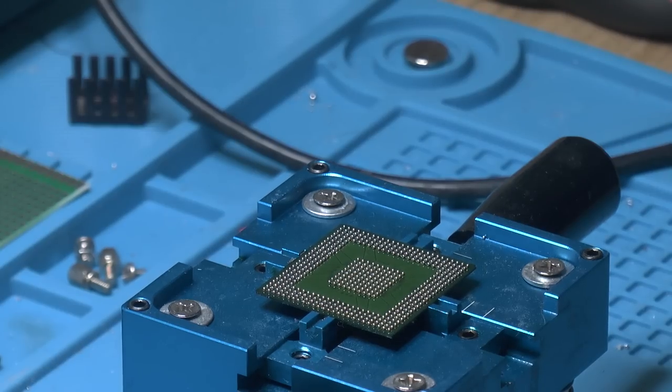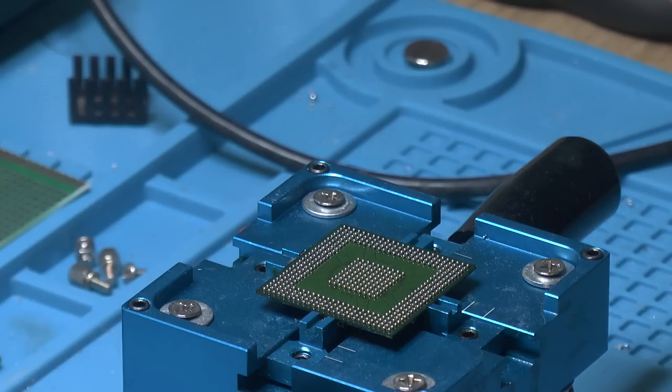With the RAM chip, this worked very well, very easy, because it can easily cover the whole chip moving down slowly, and the balls will quite easily stick where you want them. The thing is, you don't really want to put any force on the ball, but you need to get the heat on the balls and the pads for them to stick on a big chip like that. So you're gonna have to move around too, like that. You see, this can go messy really fast if this doesn't work.